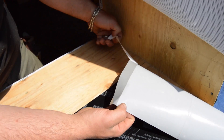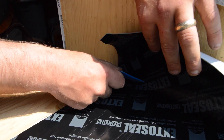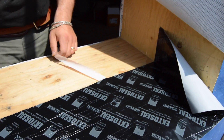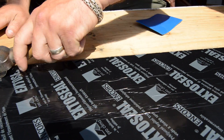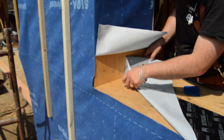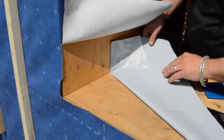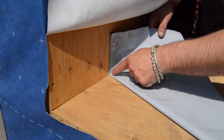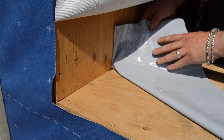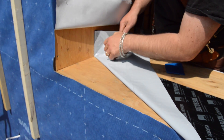The corners are stuck to the line that he snapped a few frames back. Tighten the corner with a squeegee, then pull off the rest of the backing paper. He rolls this first strip with a J roller. Removing the middle strip of backing is more touchy — you want to get yourself pulled back so that you're beyond that corner. If you go to pull the release paper off while too close, it'll often kink and tear right there, and then you're trying to chase a little edge to get it peeled back. It becomes a nightmare.